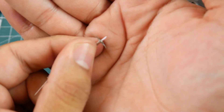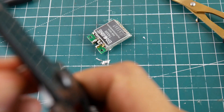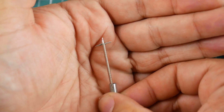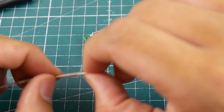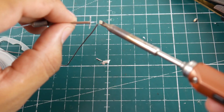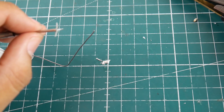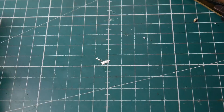Some of the inner conductor is exposed now. One thing that's important: you don't want the outer wires to touch that middle one. What I like to do first is solder the middle part, but first I'm going to try to twist it and then add a little bit of solder to it. Grab your solder, have it just stick out a little bit, get your soldering iron, make sure the tip is clean, and just hit the top part right there so we don't get any loose strands going anywhere.